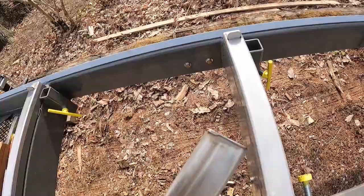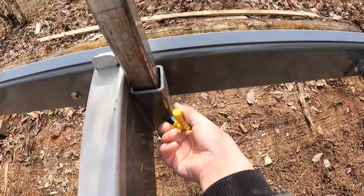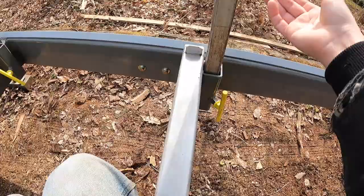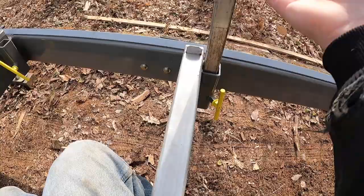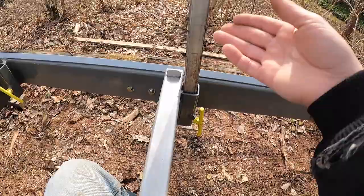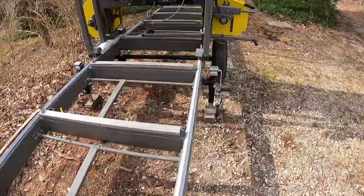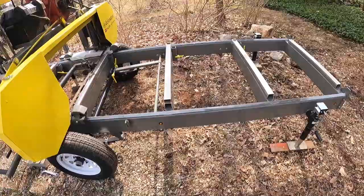The log stops are taller and I'm eventually going to cut them at an angle to make flipping logs easier. You usually run about two of these per log and set them to the right height — always pay attention to how high they are so you don't run the blade into them. That sums up the trailer overview. If you have any questions or want more details on anything, put it in the comments and I'll get back to you. Thanks for watching.